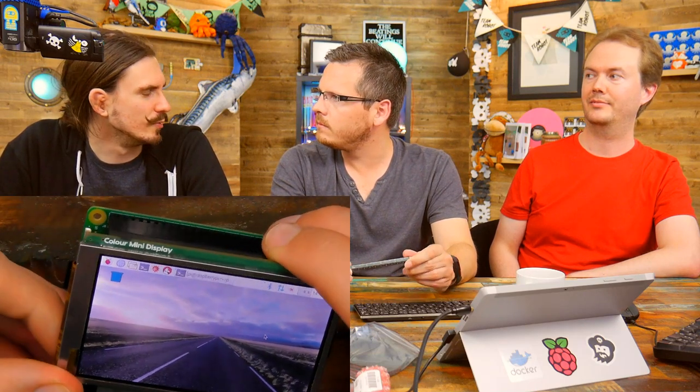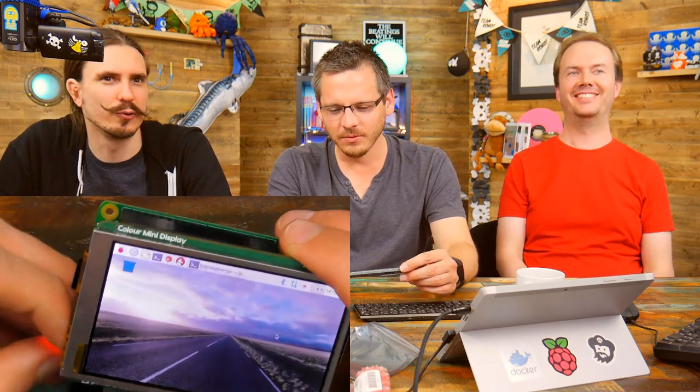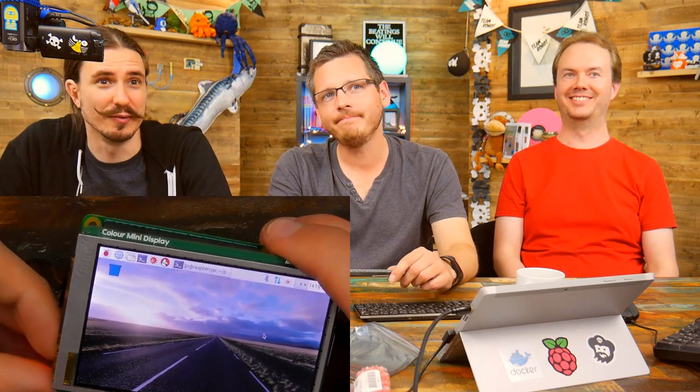Well, in fact, if you set the mode of that pin to PWM, you can use audio, but it will cause weird stuff to happen with your backlight. So you would modulate the backlight with the audio. With the audio. Which could be an interesting thing to observe. Don't do that. So that's kind of cool.